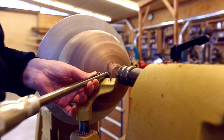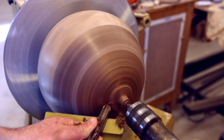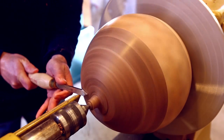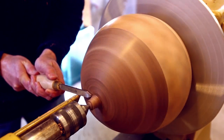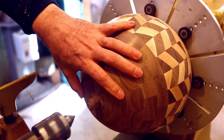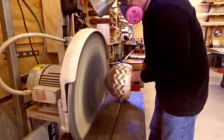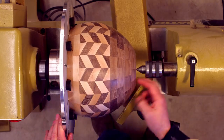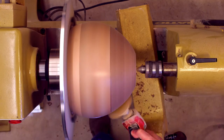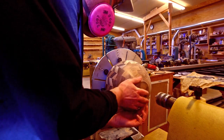I turned off the little foot that went in the chuck, then made a little base for the bowl on the bottom. The ring I'm turning now is the ring with the little plug in it — that's the same ring that's the bottom of the inside as well, so I don't have a whole lot of thickness to play with. I turned it down to a little nubbin on the bottom. The bowl just falls out of the chuck at that point, so I sanded a little bit on the bottom, put it back on the lathe, and finished up the bottom. I made a little indent so it would sit flat on the rim of the base, and sanded the bottom to match the rest of the bowl.